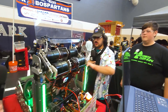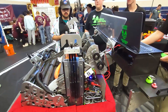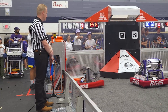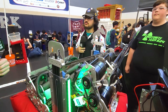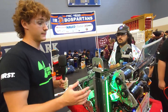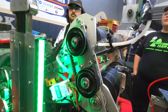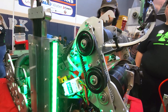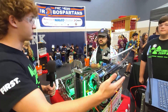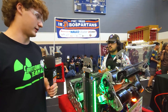Can we see that process of the note going through? Now, another thing I want to ask about is your amp mechanism over here. It seems like that's also on a rack and pinion. Yes — with such a small frame perimeter, the total amount of space for the entire amp system was around one inch to drive it and for it to move along the pinion. That's why we chose rack and pinion: it's slim, easy, and robust. This has allowed us to make a deflector out of it, like many teams have done this season, which has been very helpful.